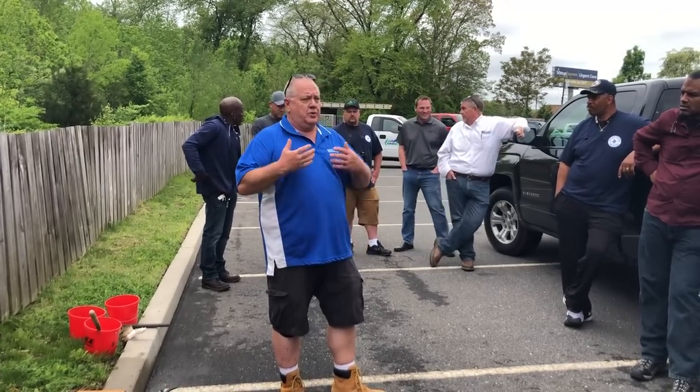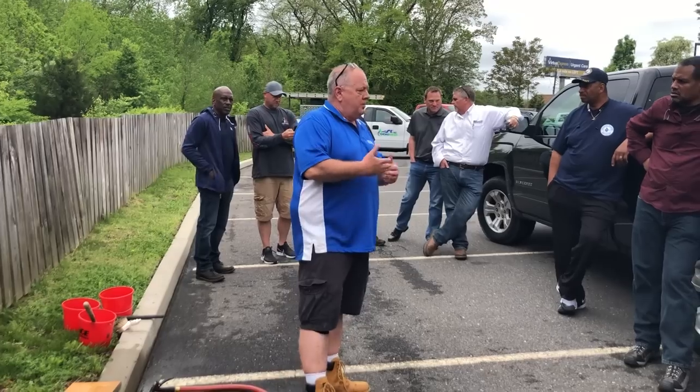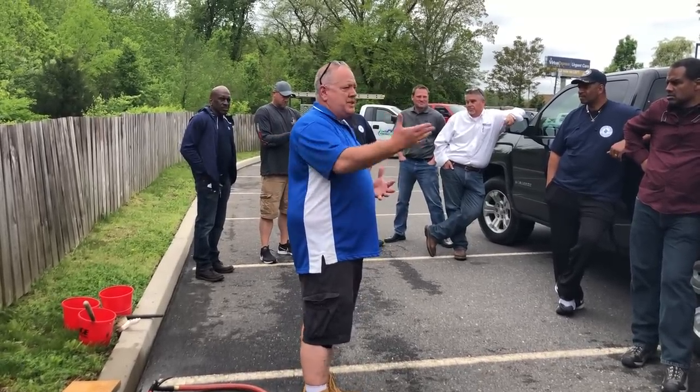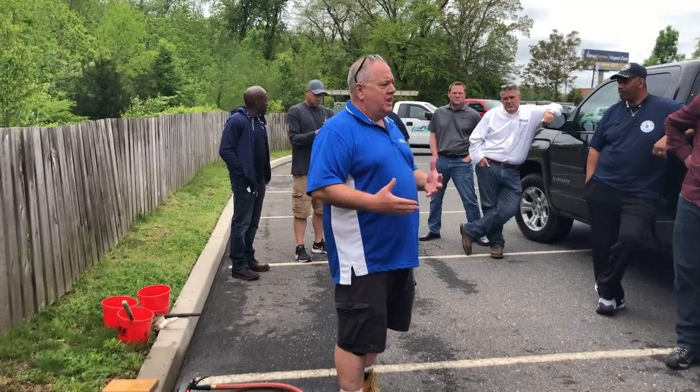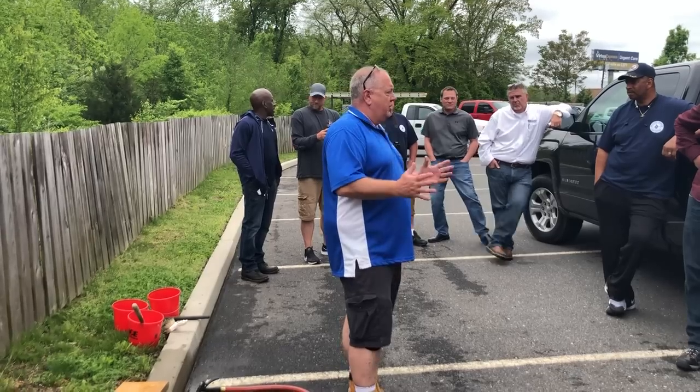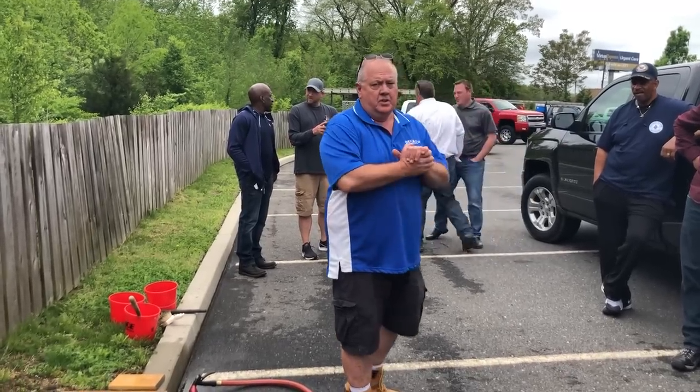Things like Olympic or Cabot, some of those come off pretty easy. You're pretty good. But like I mentioned, Behr and Sikkens and some of the others are a little bit harder to get off. So you have to be a little more patient, with a little more dwell time. That's all it is. It really is.